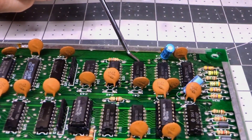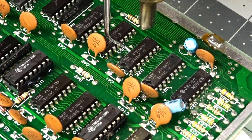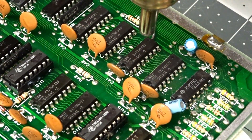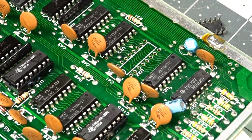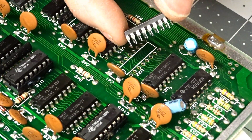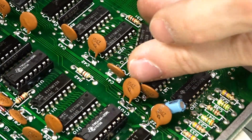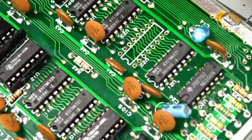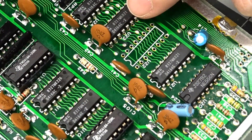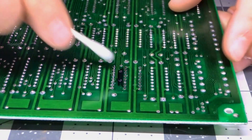That's the chip, and now I can see it's clear of solder on both sides. But just like the 40-pin DIP, this is still stuck in here, so we've got to use the heat gun. I'm going to prop the board up, give it a little heat, and because it's so small this is much easier. That chip popped right out — right out of there. No fuss, no muss. I could easily put a socket on there right now, or put a chip straight back in the board. Let's clean that up and get the flux off. And if you make a mistake and desolder half of another chip, don't forget to re-solder that chip back together before you try using the board.